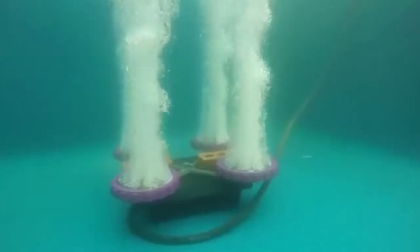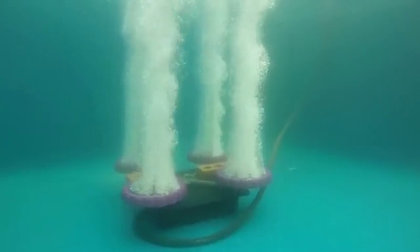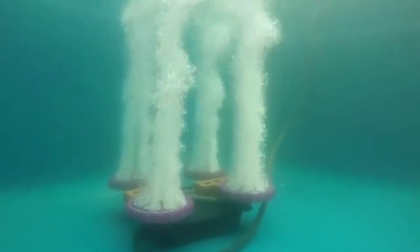Surface aeration isn't ideal at about four or five meters deep, and this dam, depending on the time of year, can go up to about six or seven meters deep. So what we're going to do is introduce the subsurface system to lift all the water from the bottom up to the top where it can get a gas exchange with the atmosphere — the nasty gases come out, the good gases come in — and most importantly, we get oxygen right down the bottom where the good bacteria need it to live and thrive.